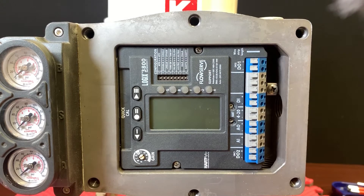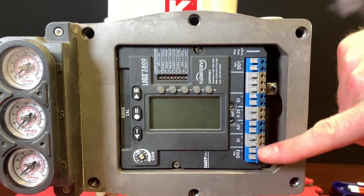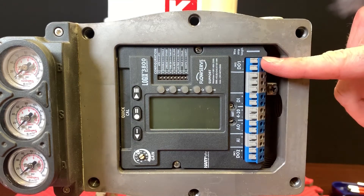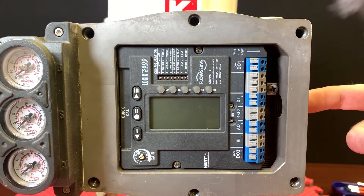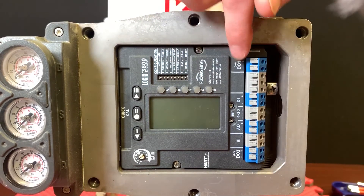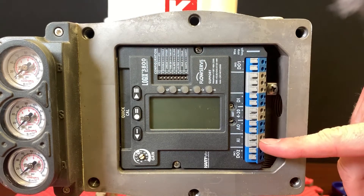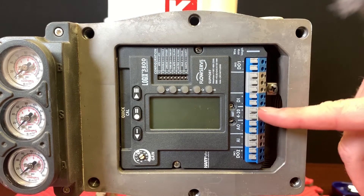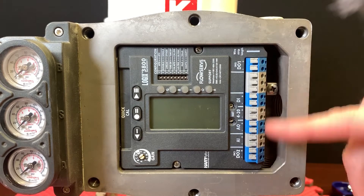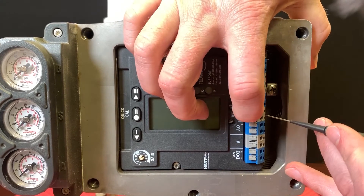I'm going to go ahead and power it on here, so bear with me. You'll see they've done some nice things with the terminal strip — you do get spring terminals here. There are a lot of features that we're not typically used to: you'll see analog in, analog out, four to twenty, digitals — a bunch of different things that are intrinsic to the design.